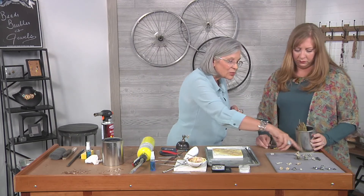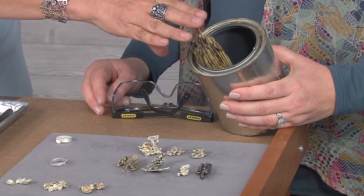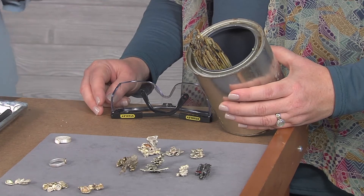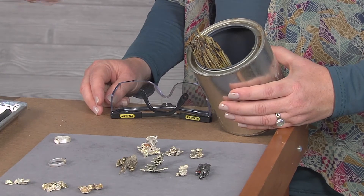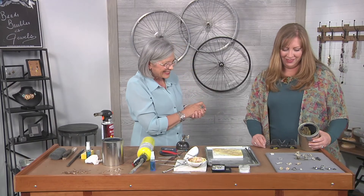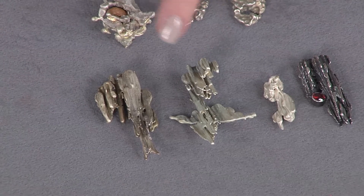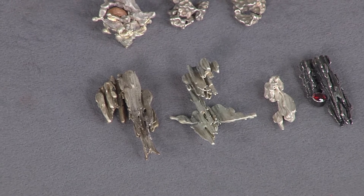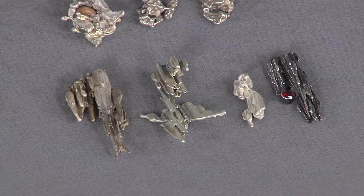There's some other casting you can do too. These pieces were made with broom straw. What you do for straw casting is soak the straw — you want it thoroughly wet, I usually soak it overnight — and also put some water in the can. Then instead of pouring into a bucket of water, you pour your molten metal down into the straw. You want another bucket because you're going to grab it with some tongs and quench the whole thing, as sometimes you set the straw on fire. The straw burns away and you can imagine the metal going down into the spaces between the straw, filling them and creating these interesting little crevices.